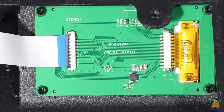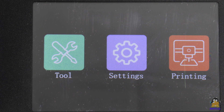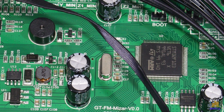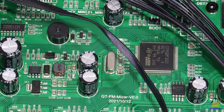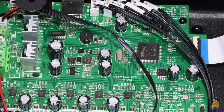The color touch screen has a resolution of 480x320 pixels. An STM32F microprocessor is placed on the mainboard, running the open source firmware Marlin. The stepper motor drivers, type TMC2208, are soldered to the circuit board.